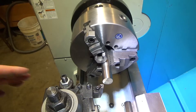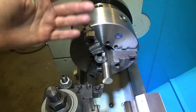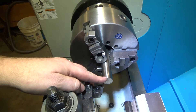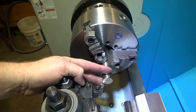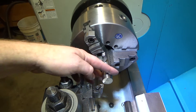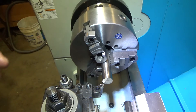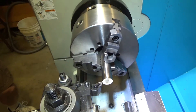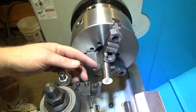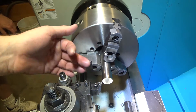We're starting with the plug that goes in the butt of the gaff. We're going to face it off, cut a one-inch section, reduce it down to the inner diameter of the aluminum tubing, and leave about a half inch sticking proud. Then we'll flip it around and round off the protruding part. This part protects the butt of the gaff from being banged on the ground. My brother-in-law is here as a guest machinist doing most of the work. We're going in three quarters of an inch and taking it down to approximately 0.879 for an interference fit.